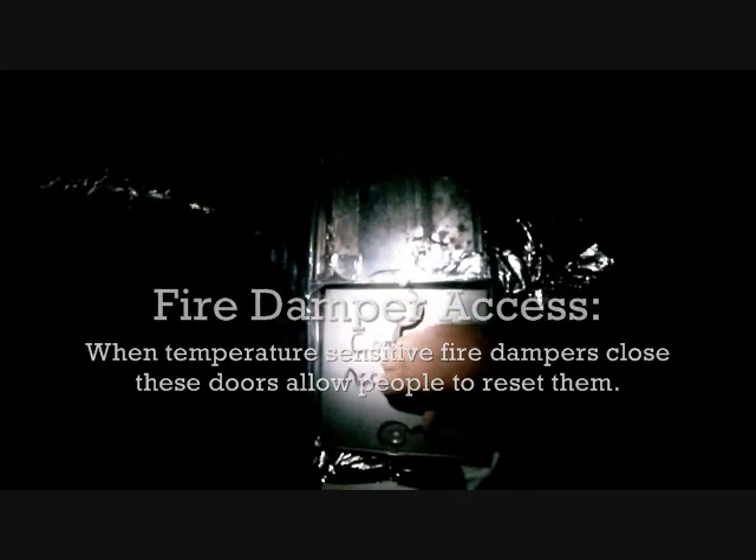You can see the grunge and grime — and that's a coil I sprayed off not too long ago. This coil is pretty much done for; we're trying to get it to last as long as possible. My advice is to get a brand new coil. This access door is essentially a fire damper access door — the kind you'd use to reset fire damper links in commercial work. It locks into place with a gasket on the inside so it's pretty airtight, and it gives you a great way to check out coils. They don't cost very much.